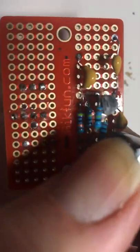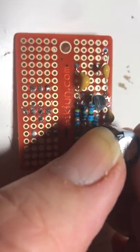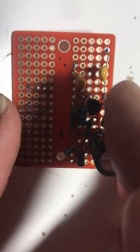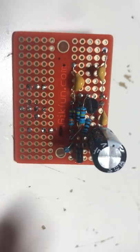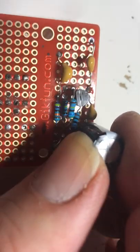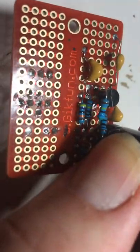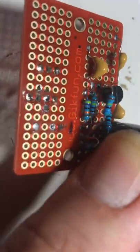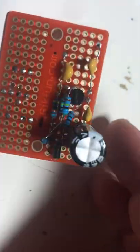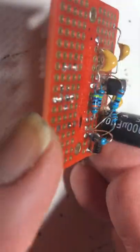On try three, I realized that all these things were connected vertically, so I put the FET in here and used the vertical lines to act as interconnects. It didn't come out as square as I wanted, but in the end I put some hacks to get stuff back to the positive supply, so that's how it turned out.